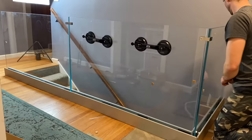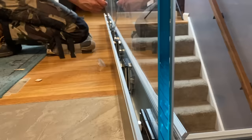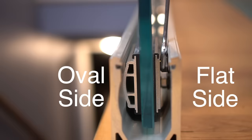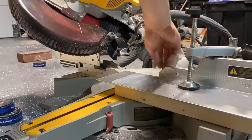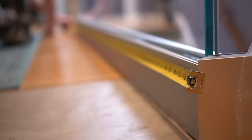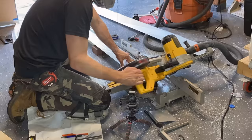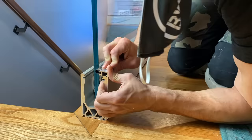One thing to keep in mind when cutting the base rail is that it has two different profiles on the inside: an oval side as well as a flat side. The oval side should always be facing the stairwell or your open-ended area, and the flat side should be your access point, because it's a lot easier to get to those bolts on a flat grounded surface versus in a stairwell. I remove all the excess shims and proceed to installing my cladding — this is just a decorative panel that snaps into place on the existing base rail. I highly suggest cutting a bit longer than expected because if you cut too short, there's no turning back.